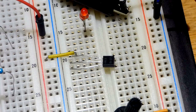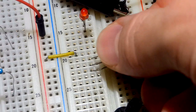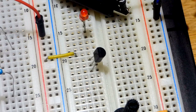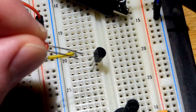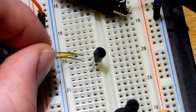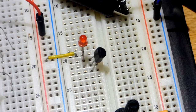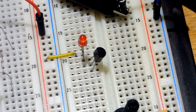It's not a current-controlled component, and if you operate it correctly you won't have current going through the gate, but it is possible. This is just a simple introduction video — I'm still learning myself. We're going to set the drain one spot below the jumper. The LED we're going to put to the jumper: long lead is the anode, short lead the cathode.